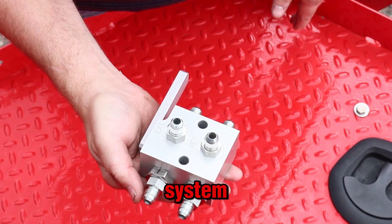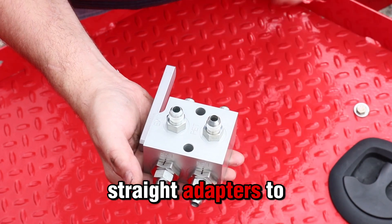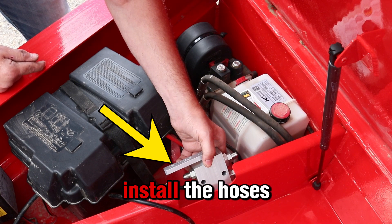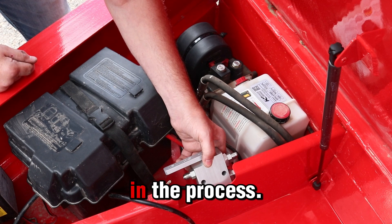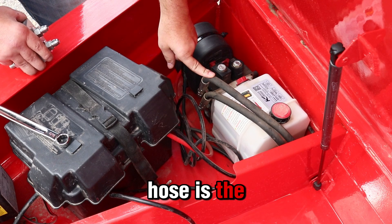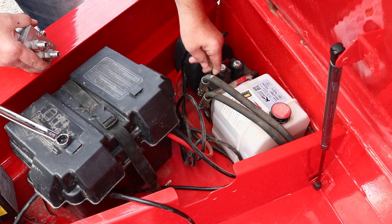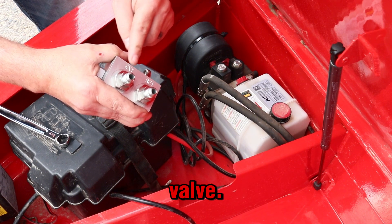For this particular system, we chose to go with six straight adapters to install the hoses. We've moved the lever on the selector valve to shut off the dump circuit. We want to make sure when we install the hoses to the selector valve that we don't lose any fluid in the process. To identify which hose is the extend, track it down to the base end of your cylinder on the scissor hoist under the trailer. Remove that hose and install it to the extend on the selector valve.